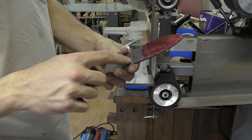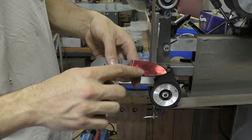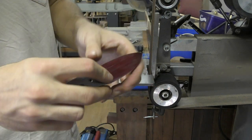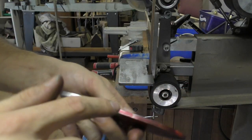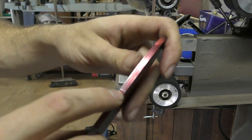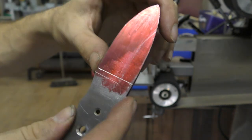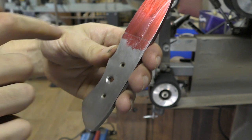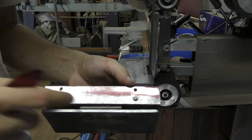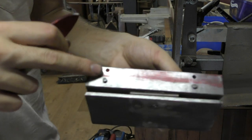At this point we have it rough ground, our two pin holes drilled, and we also have this third hole — I'm going to show you what that third hole is for in a second. We have where we want our bevels to come to marked out, as well as our center line on the front and back. That's to help with distal tapers, as well as things like a bevel on the reverse end — a fake edge — that's where the center line comes in handy. You'll also notice we have a line that comes all the way around marking our stopping point. One of the main changes I've done to this beveling jig is there are extra holes here that I can arrange however they need to be, perfectly in line with the ones below them as well as each other.